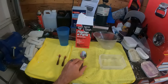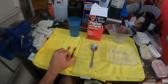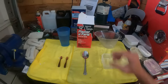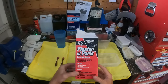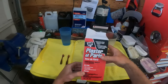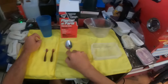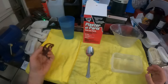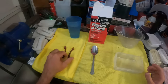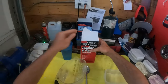I've gotten a couple requests on how I pour or cast my molds for my custom fish and lures, so I figured I'd make a video on the process and show how easy and quick it is. For this video it's going to be made out of plaster of Paris — you can get this at Lowe's for about nine bucks, a four-pound box. It sets hard in 20 to 30 minutes. Aside from that you need water, a large measuring cup, a spoon, a little container to cast the mold in, and one or a couple of the plastic lures you want to make a mold of.